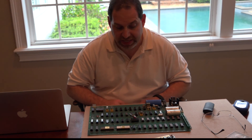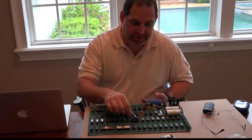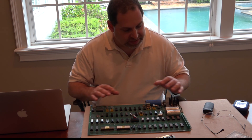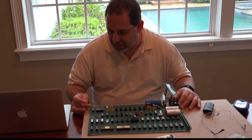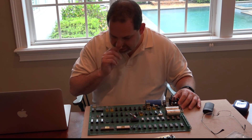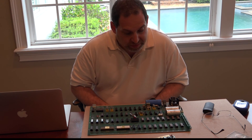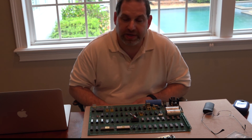I haven't seen one like this, and this doesn't look like someone just hacked up a board. Someone was doing something purposeful with this relating to memory refresh, and even flipping around switches and other things. From a preservation perspective, I would probably clean up the corrosion — there's some moisture damage that has affected some components attached to the board, like the video pot and possibly the transistor. A lot of these chips are TI chips which tend to corrode, but the sockets are RN sockets, which tend to be much better than the TI sockets Apple originally used. I wouldn't reverse any of the modifications, because that's kind of cool considering what this may have been used for.